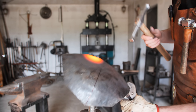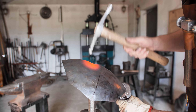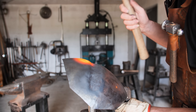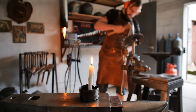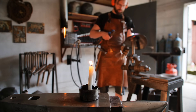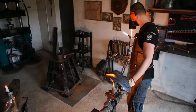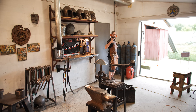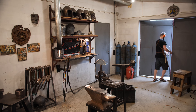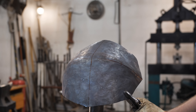Now I'm using the raising method. Its main principle is that the cold part is touching the device and we are hammering the hot part. Such a method allows us to lower the material essentially without losing the thickness. Meanwhile, the reptiloids from the power company used their magic and our village has power now. I worked with raising starting from the central line, which is why a bulge for a future rib has been shaped here.